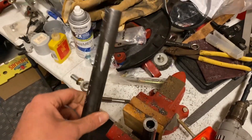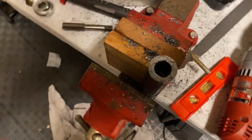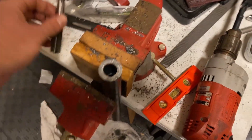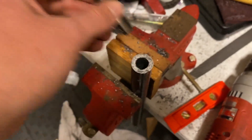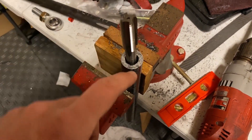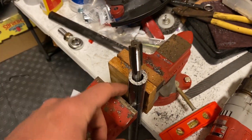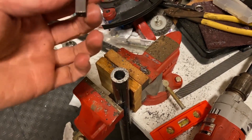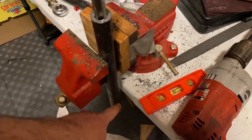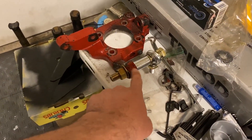I cut the two-foot rod in half into 12-inch pieces and I'm drilling a 9/16 hole to thread the left-hand tap for the outers. I don't have the other tap yet. Right now I've drilled the hole using an electric drill and the vise, being very careful to go straight. I'm almost to the point where I can tap the hole and thread this piece onto that one. I'm not sure if this length will be right - I may have to shorten it.